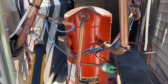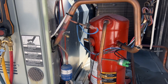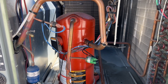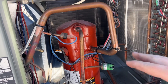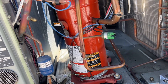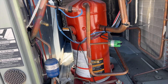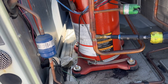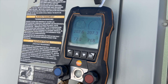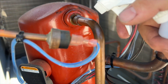I'm back — it's about two days later. We got our approvals to do the nitrogen test. Apparently we couldn't get a hold of the person who authorizes this stuff, so I couldn't do it until now. I got the ports off and I'm going to pull out the Schrader cores — makes things a little bit faster. I got it up to about 200 PSI and it's definitely losing pressure. Found it — right there.